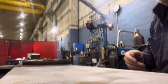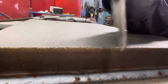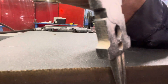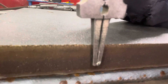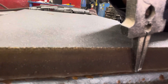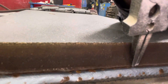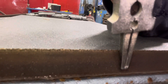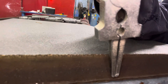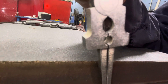All right, got the bottom bead now. You can see the bottom bead there — it's half on the base material and halfway up the other bead, with a little bit of a hump right here. It also makes kind of a little seam in there. So the next bead is going to be a regular fillet bead right in that corner.